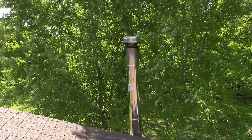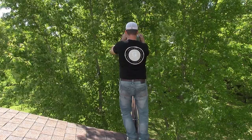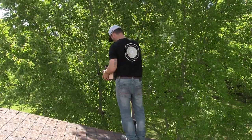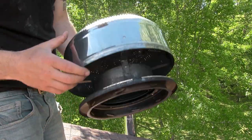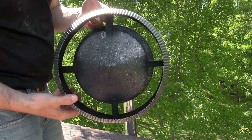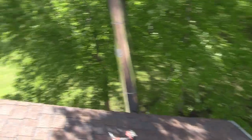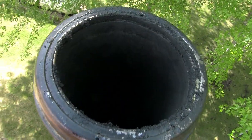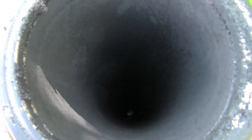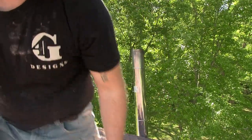When we jump up on the roof we're going to remove the rain cap, inspect that for any damage or if there's a bird nest in there — just give it a good once over and make sure everything looks nice. Take the camera over and take a peek into the chimney pipe. We want to get all that scale off because that can become very flammable, especially if it looks like oil. All the stuff in mine looks like it's just dry and crumbly — that's okay but we still want to get it cleaned out.